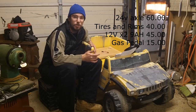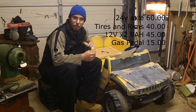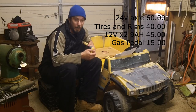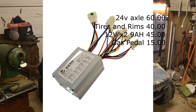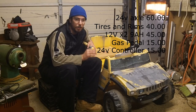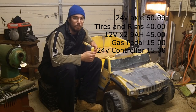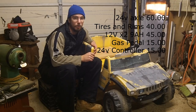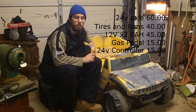The next thing you're going to need is a 24-volt controller. I looked on Amazon and found some, but I went with the cheapest one at $15 and realized later I probably should have spent more. What you end up realizing is that it's not weather resistant, and that's a key thing — it's a power wheel, the kid's going to leave it outside. A weather-resistant controller is going to cost you somewhere around $30, so don't make my mistake.